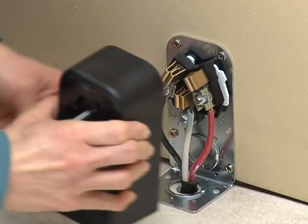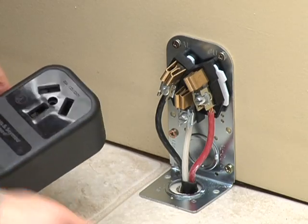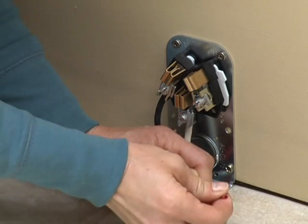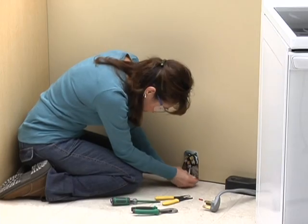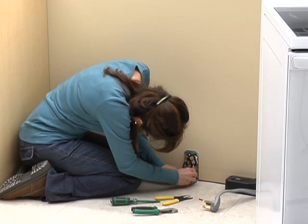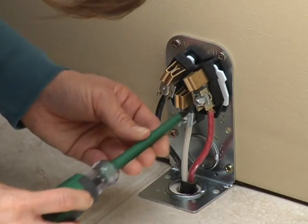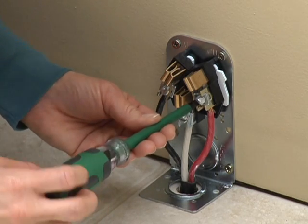Make doubly sure the power is off. There is a lot of power flowing through the lines. Then, strip about 1/2 inch of insulation from the wire end, but don't bend a loop in it. The wire should remain straight. Loosen the screw, insert the wire in the hole, and tighten.